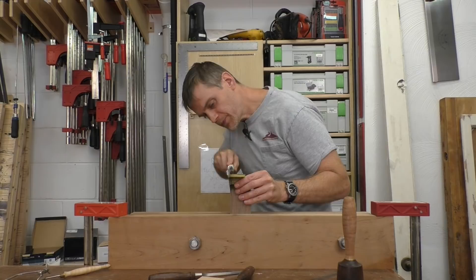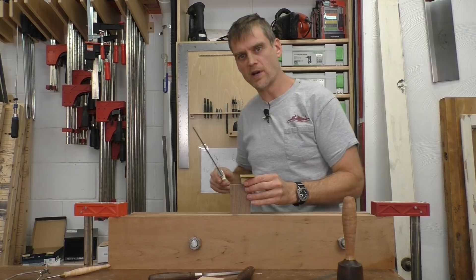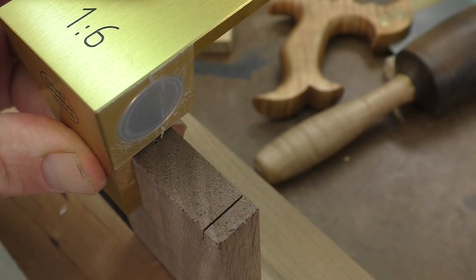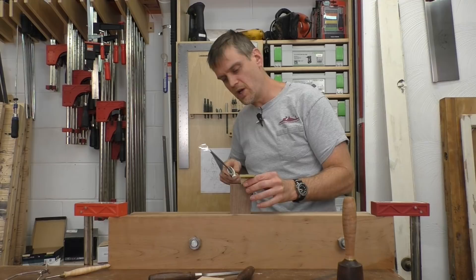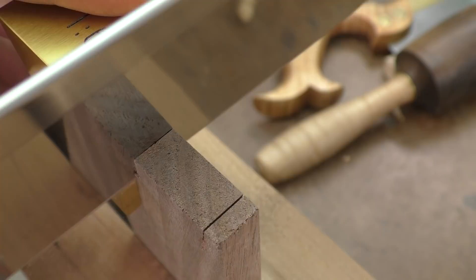Let the saw do the work. Make sure I am good front and back, then move it over. I am going to stay on the right-hand side of the guide because I am right-handed and cut the next slope — it is going to be the other tail — using the same slope on the right-hand side of the guide. Just let the guide guide the saw and simply saw straight down until I get to my mark.